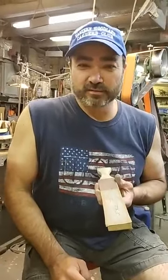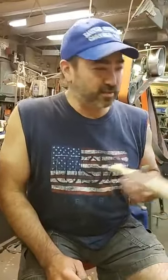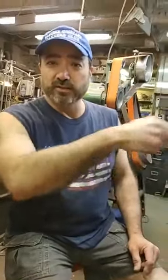Because you're going to go to the belt. It would have taken me literally, I don't know, 10 seconds. 2 seconds on the belt, 2 or 3 seconds, and then a quick, easy, light buffing because I know that the cutting edge is already there. So if you have a belt sander, it doesn't have to be a knife-making belt sander. It can be one that runs this way to do your handles or